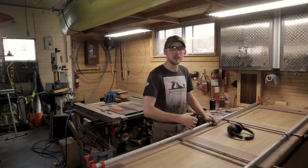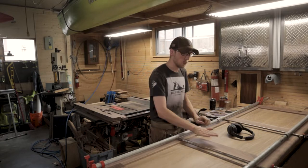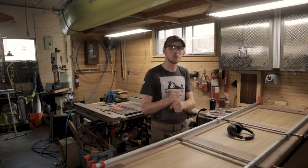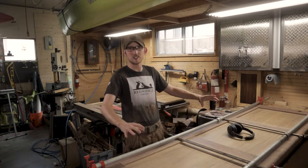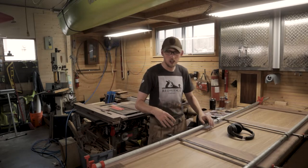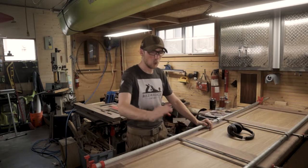So when we put that dowel in, it'll basically do the same thing as drawboarding, where it'll lock these pieces in the tightest spot they can possibly be in. Then once we have our middle ones done up, we're gonna disassemble all this craziness so that I'm not having to flip things around as much. Then we'll just focus on doing one corner at a time.